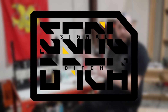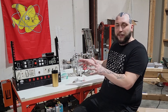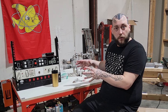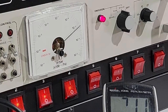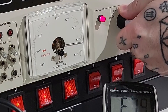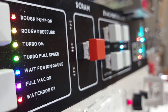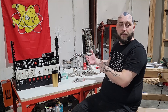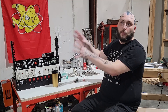Last time we talked about this system, most of the mechanical portion was already plumbed together, and I could pump the system down and bring it back up by manually actuating all of the relays and valves involved. But the end goal was always to put it under automatic control — not only because I would have my hands full with other things while pumping down a tube and may not be able to watch all of the gauges, but even if I see something going wrong, I may not have enough time to react. A microcontroller whose only job is to monitor the system will be able to react in time to shut valves and prevent pumps from getting bogged down with overpressure, or prevent oil from getting sucked out of the mechanical pump into high vacuum parts of the circuit — all of the bad things that can happen when you're doing this manually, just watching gauges and turning dials.